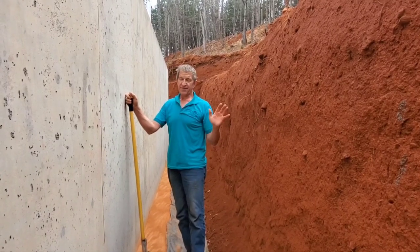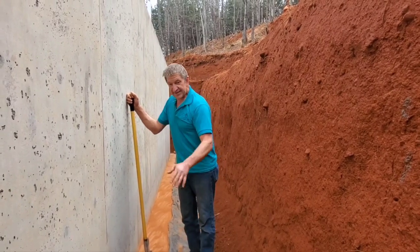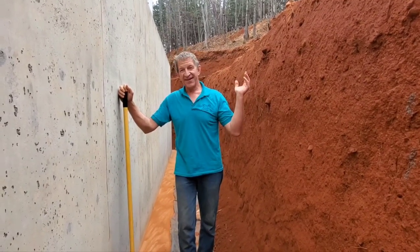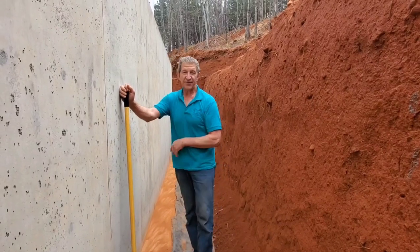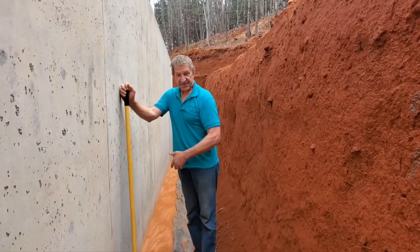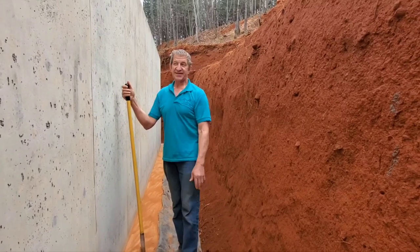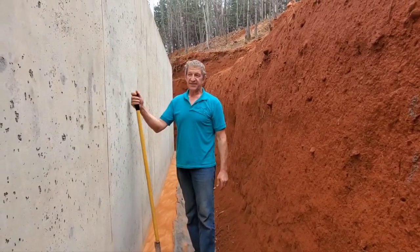Really trying to keep the inside of the house super dry — you should never ever need a dehumidifier the way this is being done. I could have power washed this but it's February, I've got rain coming and freezing weather. I only have so much time, so I'm just trying to get this cleaned off, use a leaf blower to blow all the dust out, and get a coating on it before rain or freezing temperatures come in — the waterproofing needs to be applied around 60 degrees.